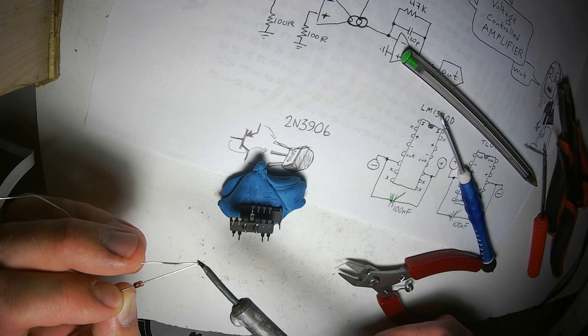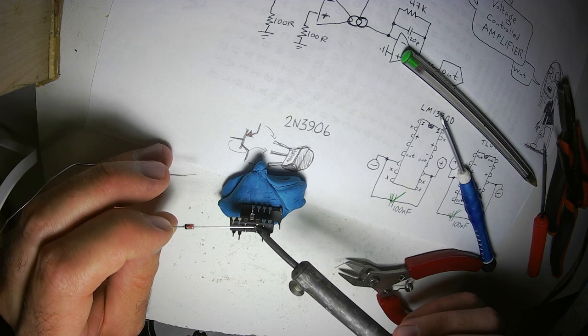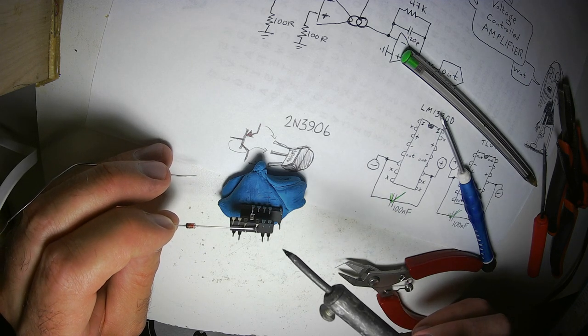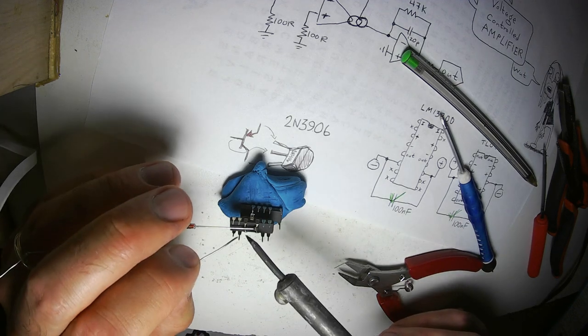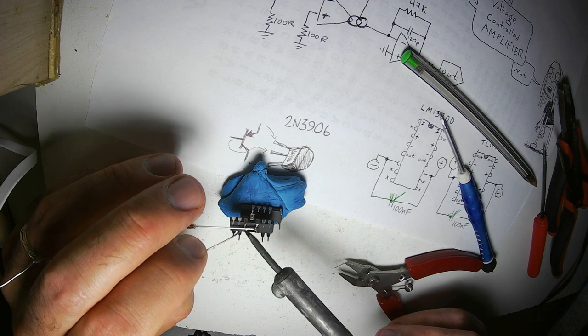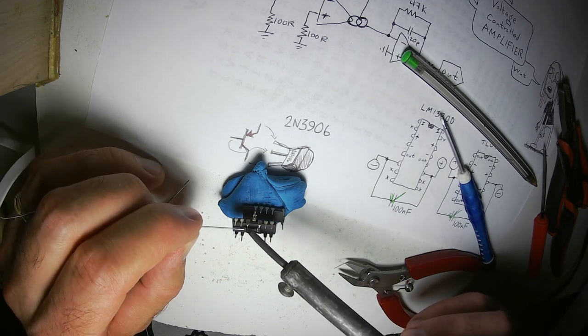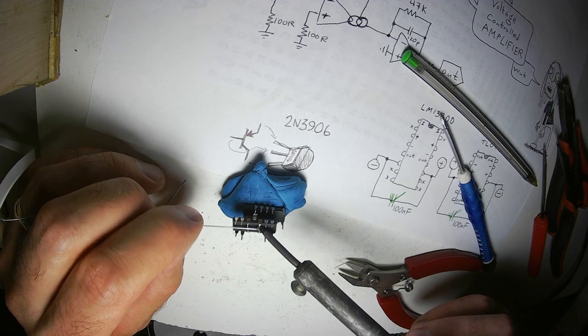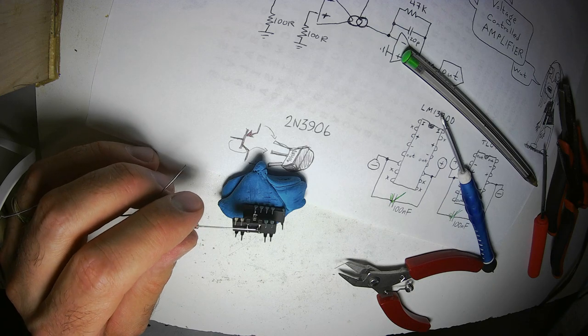Building something that makes noise, like a voltage-controlled oscillator, or something that drastically changes. When I say noise, I mean sound. I don't mean noise. Of course, in that case too. But if you're building a circuit that creates a signal, having a star ground is not quite as vital.